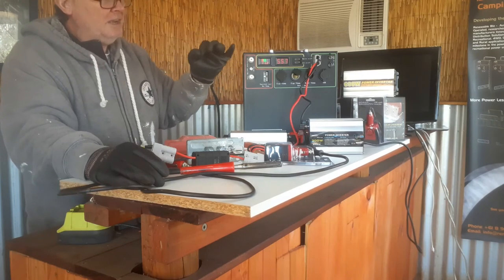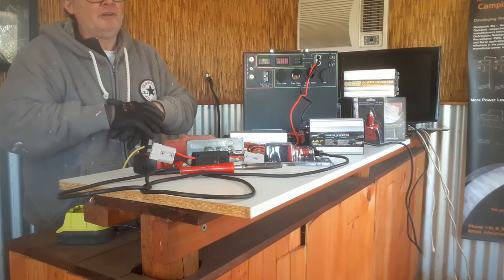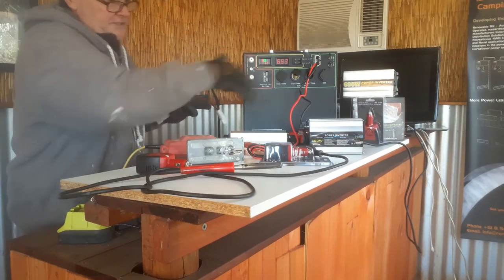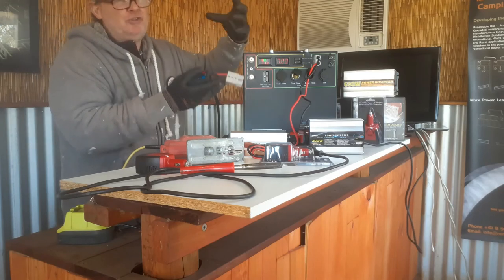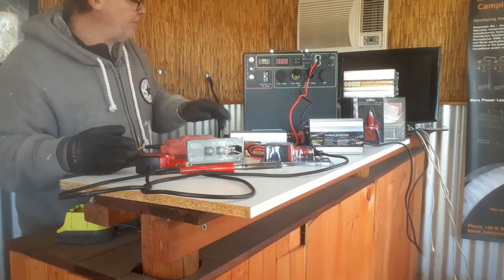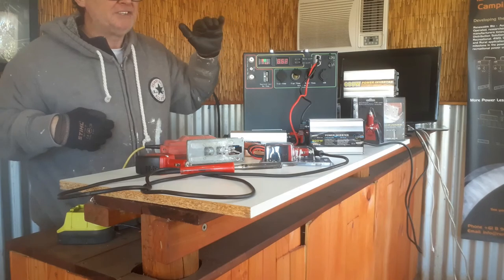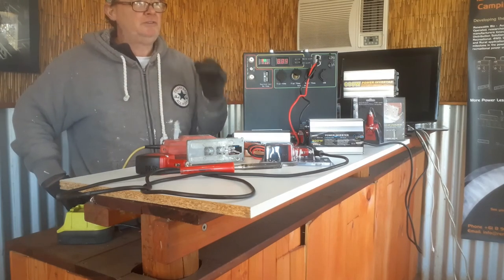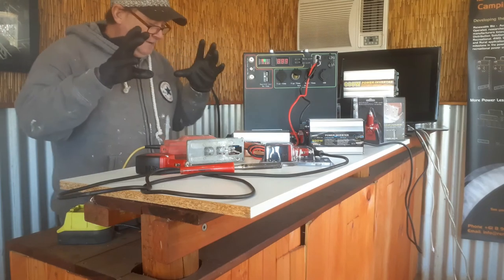If you're new to camping and damage your electronic equipment in the bush, you're in serious trouble. There's a lot of capacity in these units to get you out of trouble, but you need to understand your accessories — how many watts and amps they draw. That's why the analyzer is great: it teaches you all about your setup, whether you're off-grid or setting up a vehicle. You can confidently say: my fridge on average draws about 1.5 amps, peaking at 7 amps — and your inverter will handle it. Do not exceed the continuous running current.